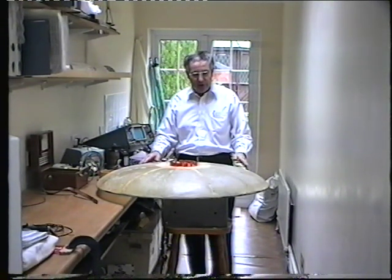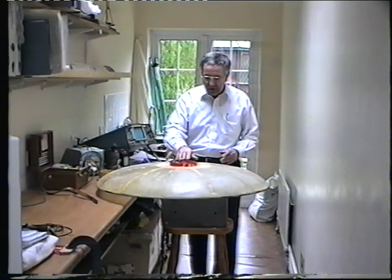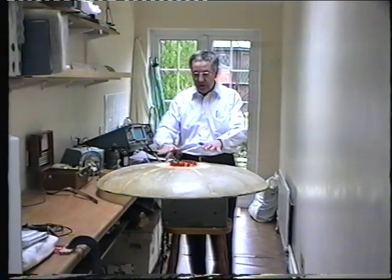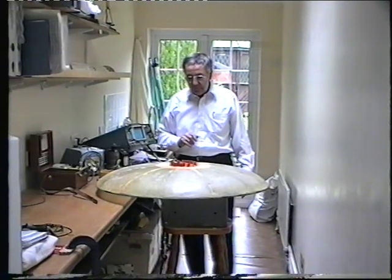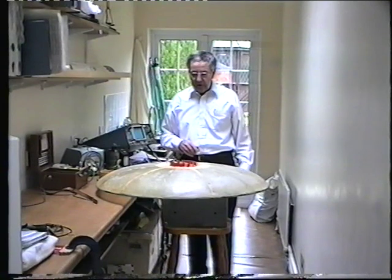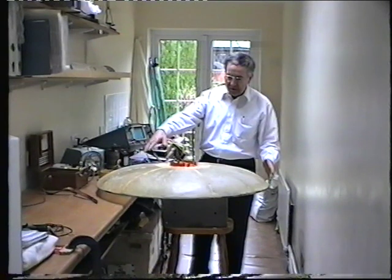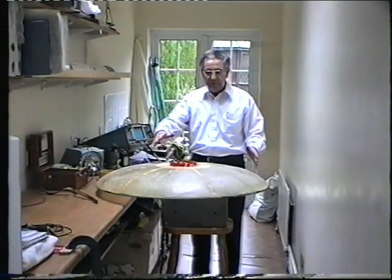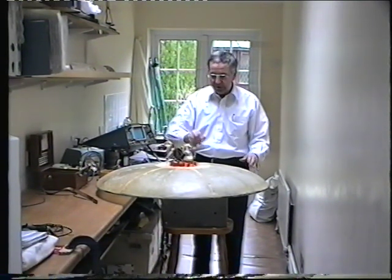There's absolutely no fear of this taking off and flying. This propeller is very small and it's not the best design by any means, but it will produce a fairly modest airflow over the surface, which should just tell me exactly what I want to know. Just to be absolutely certain, the thing is solidly bolted down to a large heavy object, and as you've probably observed, there's no torque countering device presently fitted, so the first thing that would happen if there was any possibility of this flying was that the body of the aircraft would spin in the opposite direction of the motor.